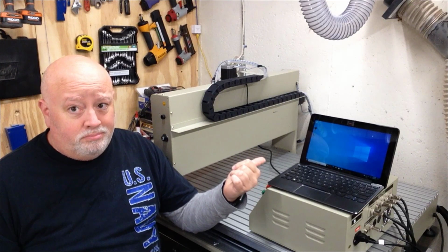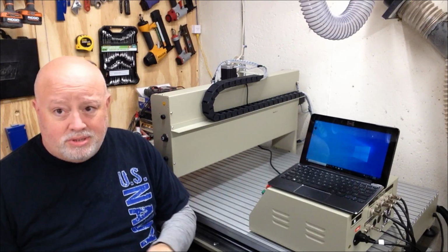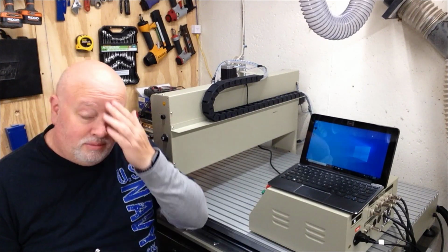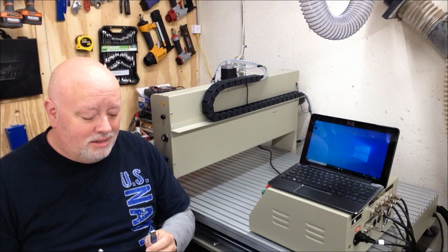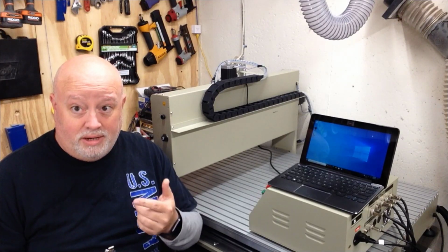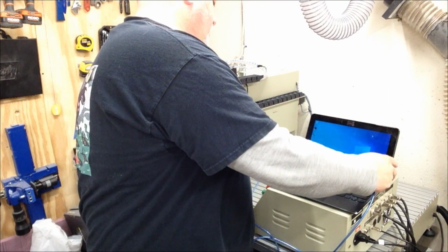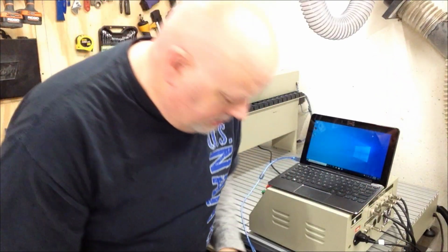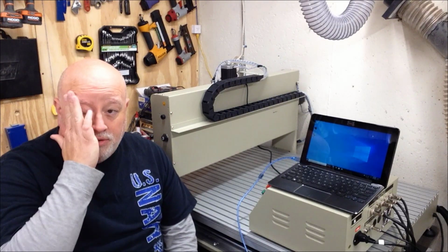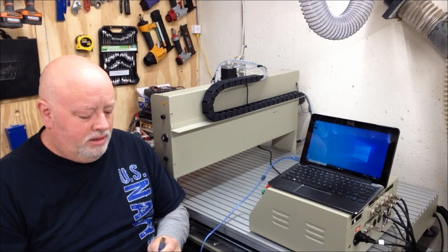I'm just using a little Dell touchscreen laptop tablet that I had lying around. It's got Windows 10 on it, and that actually should work just fine for Mach 3 with the motion control DLL that they did provide. It is the RnR Motion, which is not what they said in the description it was going to have, so I'm kind of excited about that. It's actually a good little DLL that goes with a control board that I bought for my Fireball V90 too. So I'm kind of familiar with it. I did load the other files that were sent with it as well, which were XML files for the mill profiles within Mach 3. Those should be in here already, but I'm going to get this connected.